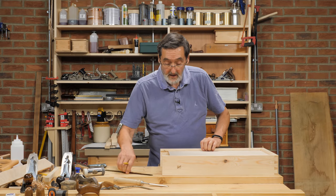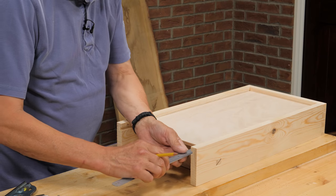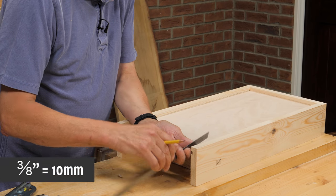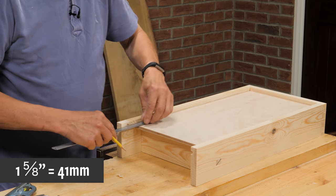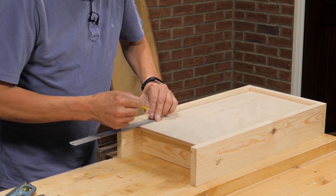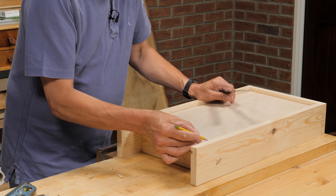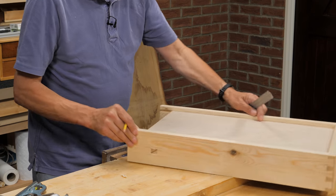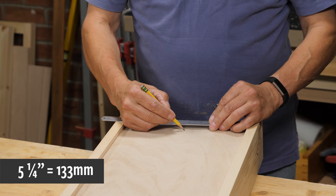on this underside. So I've got to go into the center. I'm going to put a screw here, screw here, screw here. So I'm going to measure, and I want 3/8 on. So I'm going to come an inch and 5/8 from there, just to get the position, to get the middle one just come in here. If you have, I've got 10.5, so that's 5.25.